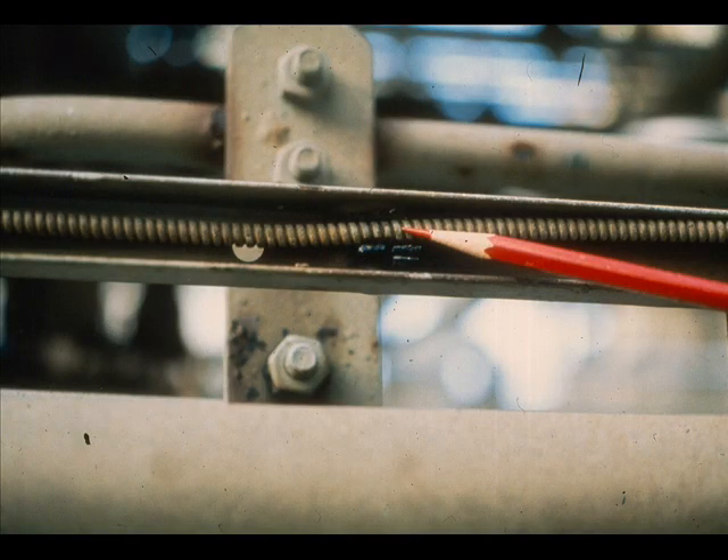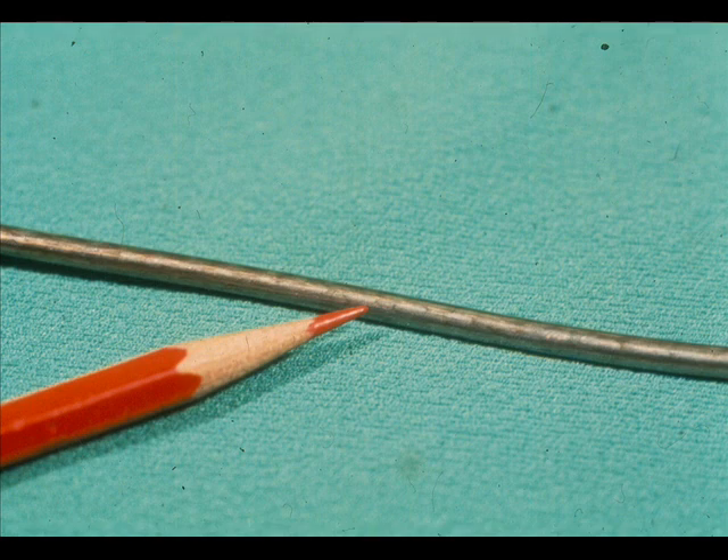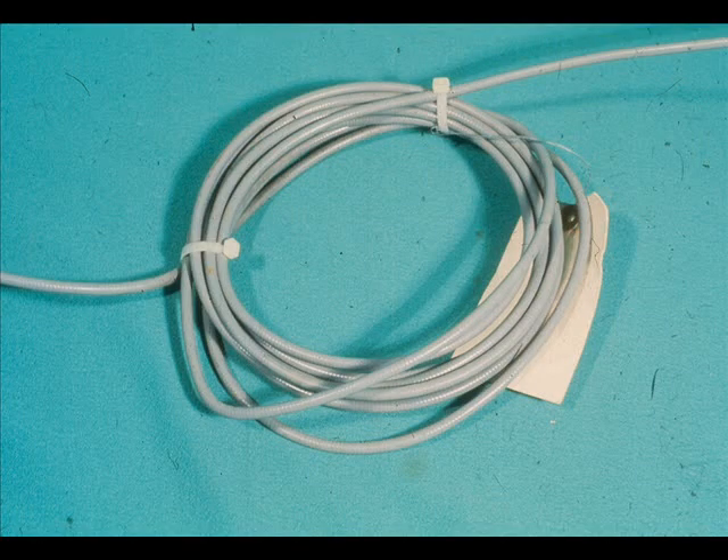The capillary tubing should be securely fastened in such a manner that it is out of the way of operation and maintenance personnel. Keep it away from areas where it can be stepped on or have something dropped on it. Most installations will have heavy stainless steel capillary tubing. The delicate copper capillary tubing will have a protective shield of spiral wound copper, lead, rubber, or plastic.